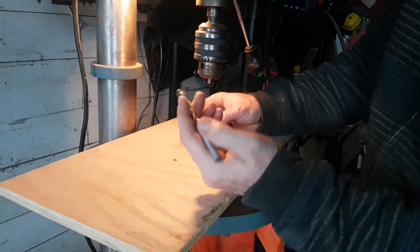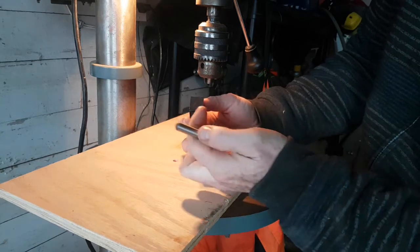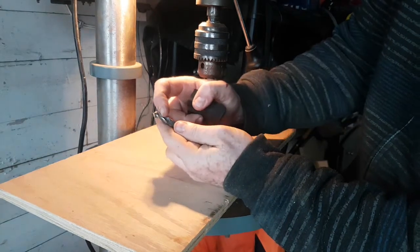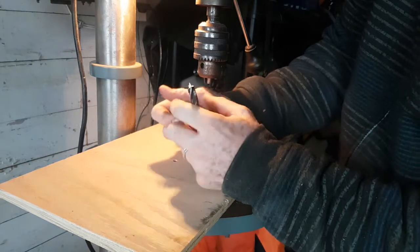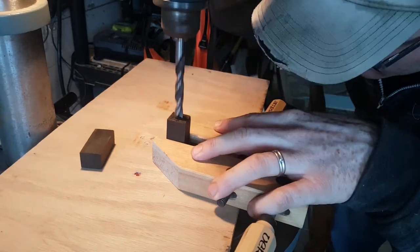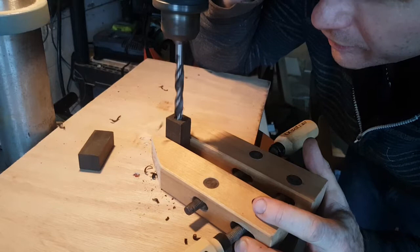We need a 10 millimeter drill bit. I like to use a nice Brad point tip for hard, dense woods. We're going to want to drill slow because we don't want to expand the wood inside by clogging it up with extra wood — that pushes out and cracks the wood. One shot — I think I'm pretty good on center here. It cuts nice.